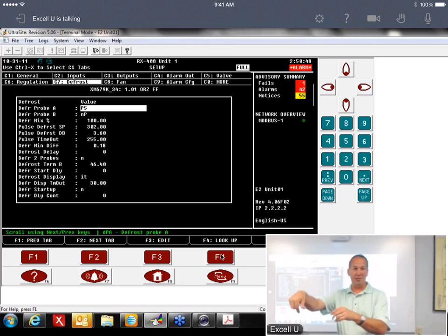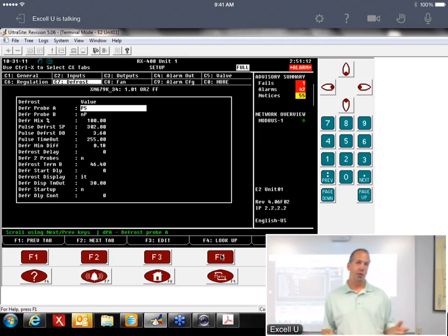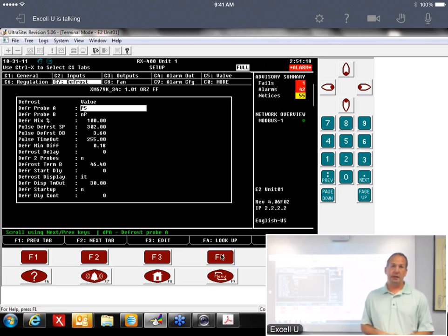That was the other thing too. You couldn't get to it. It was in the center, so you had to pull the whole bottom of the case, pull the fan shroud to find the thing. It's not a good spot. What they did now is they put it in an empty slot in the bottom from the side of the case where the expansion valve's mounted. They've actually got it inserted into the bottom of the coil into an empty slot. So it works a lot better now. But again, 1333, I'm willing to bet it's in the wrong spot.